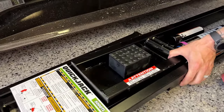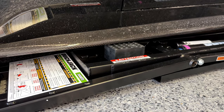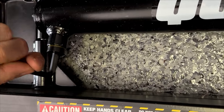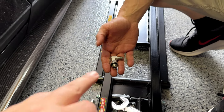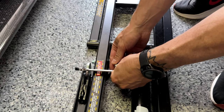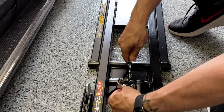Here are the tolerances we're playing with — she barely fits, but she fits, so it'll work. First step: remove the bolt on the end of the Quick Jack strut. Second step: put the little valve onto the same plug you just removed and tighten it down with an 11/16 wrench, angled up toward the back of the strut just a little bit.